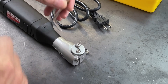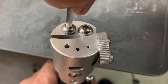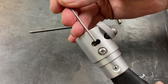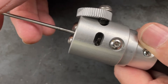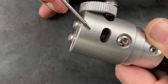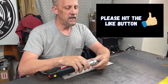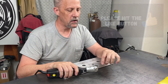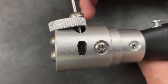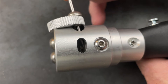I have the 3/32nds installed, and then you have two other storage locations for the 1/16th and 1/8th inch collets. There are three holes on the top where you can run the tungsten right down in there and it'll hit that blade and put a flat tip — or take the point off — which some guys prefer for aluminum. There's also a viewing window on the side so you can watch the tungsten as it gets ground and see when you're done, so you're not grinding off more than necessary.